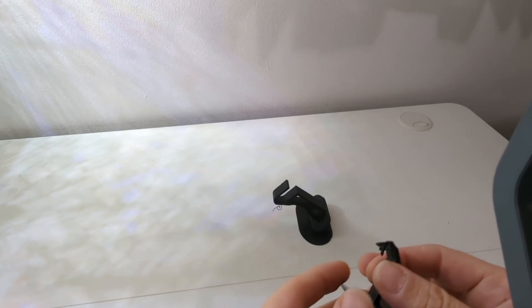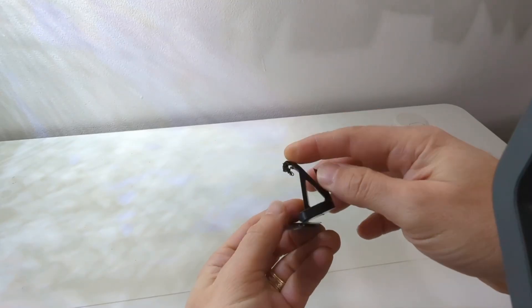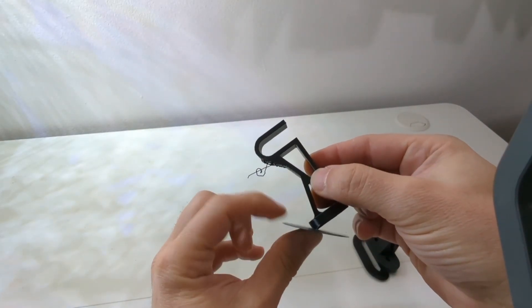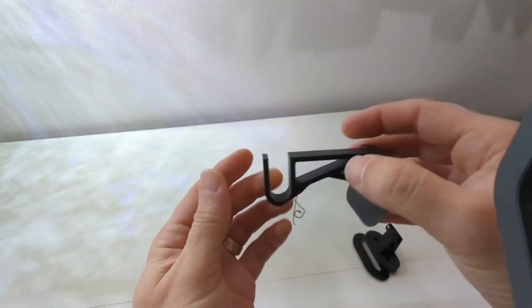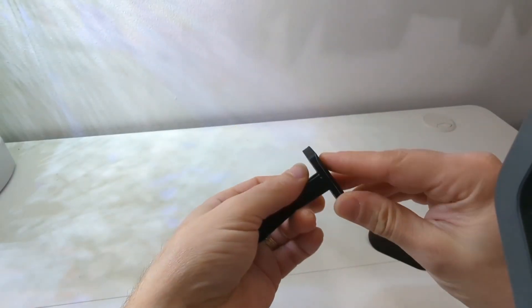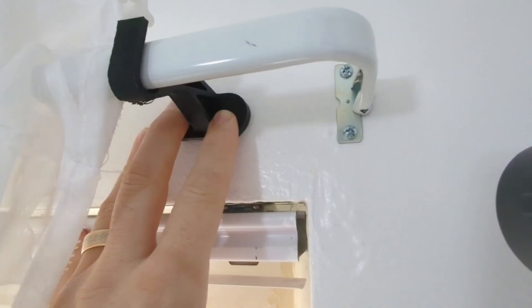I want to show what the pieces look like. This was my first piece — I printed it at the 45 degree angle and the nozzle collided with the part and snapped it off. That one failed, so I had to increase the brim size. I made the brim a little bit longer and it held intact — thicker than a few sheets of paper. I noticed a small issue with printing in one area, but other than that it did a pretty good job. Now we can put a couple screws inside and mount this to the wall. Let's tear off this brim — there we are. Hope you enjoyed the video, thanks for watching, bye.